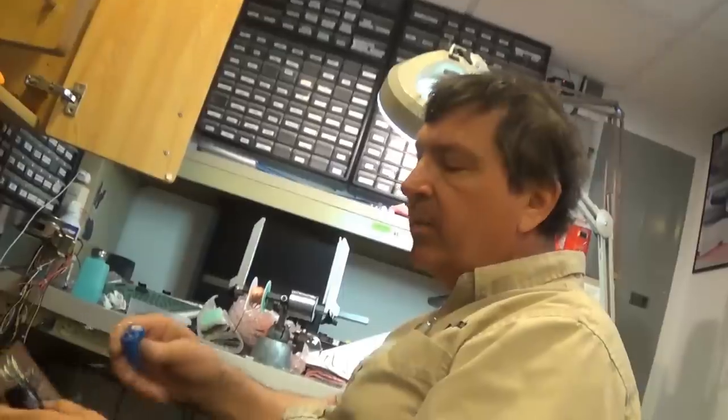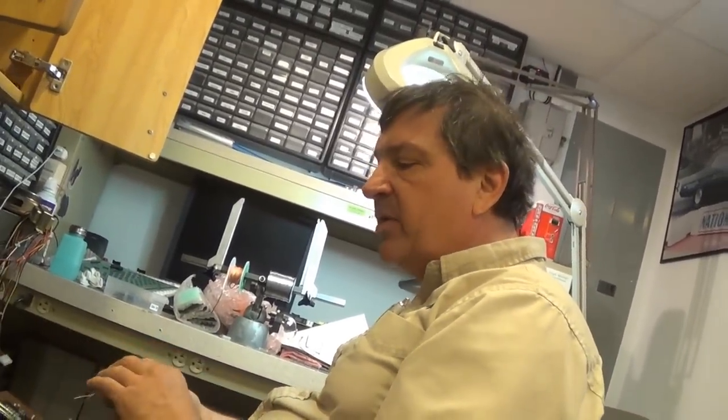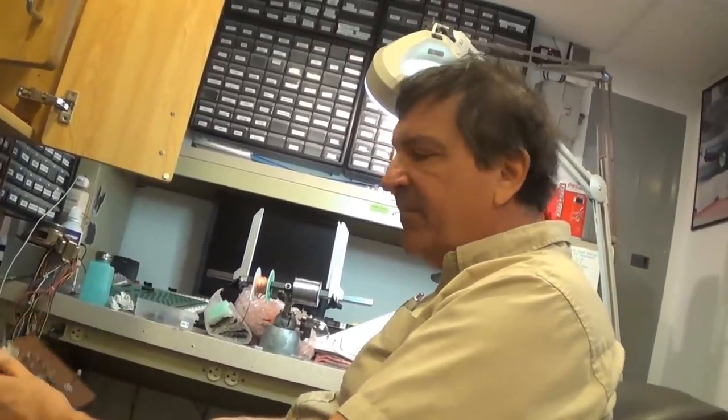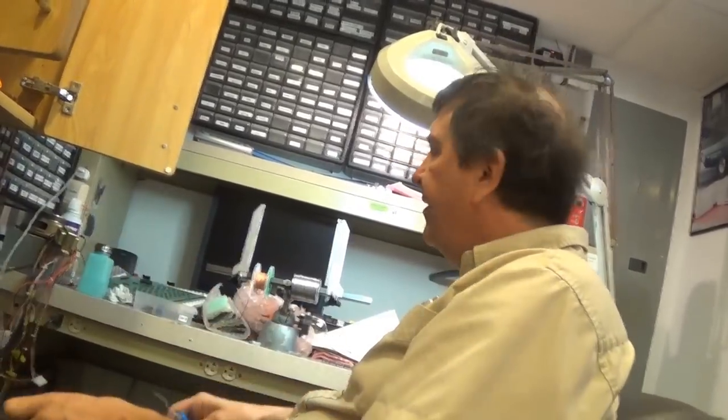Yeah, you don't want to go too much higher in filtering because it takes too long to charge that up when it's activated as a circuit. And it's too hard on the components if you go ridiculously high. But you want to stay close to it within a certain percentage. Most of these, since this was not a medical device, since this was a game, tolerances were huge. Tolerances were 20% plus or minus. Hell, this might even be right where they are anyway.